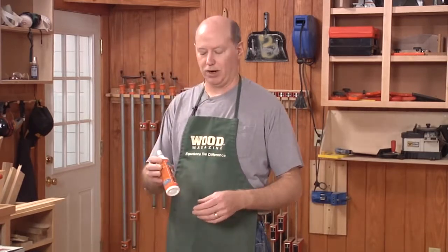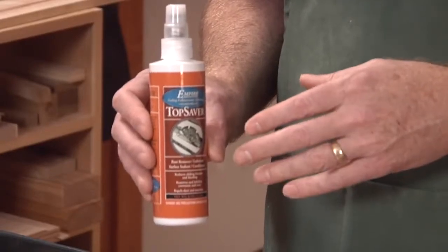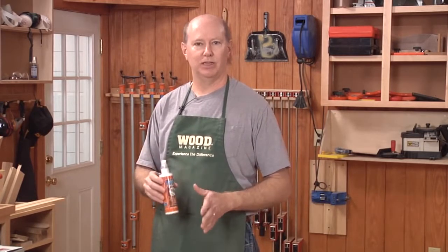The one I'm going to use today is from Empire Manufacturing, called Top Saver. It's not as caustic but works the same — removes the rust very well and also has a little bit of a protectant in there to keep rust from coming back. The thing about this one is that it will leave a little bit of shadows if there's a serious rust stain, leaving a dark shadow on the cast iron. It has no effect on performance afterward but it does remove the rust very well.